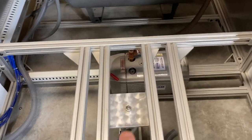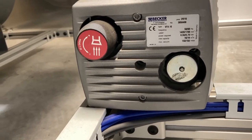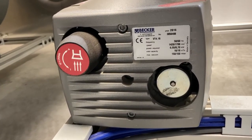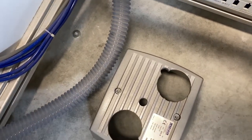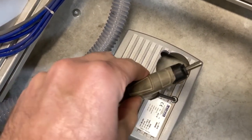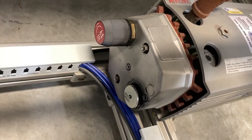Let's start taking off this cover right here — if you saw our previous video a few years ago, there are a few bolts down here. It's a 3/16ths hex head Allen wrench to get those two bolts off, then two more to get this cover off, which gives us access to the filter. After that there's a bit more work to get to the actual vanes on the pump.